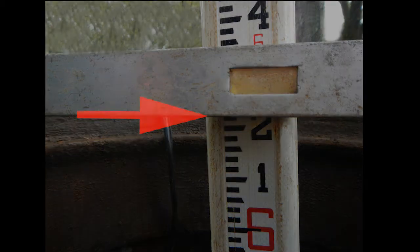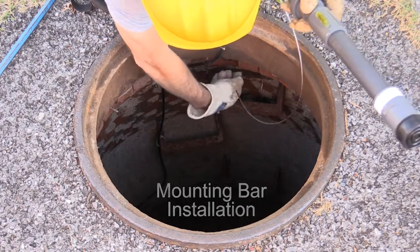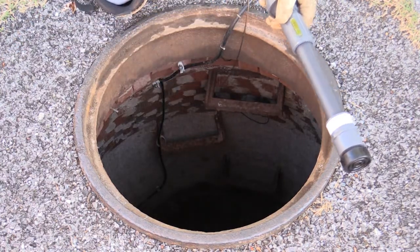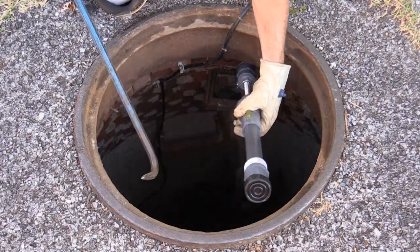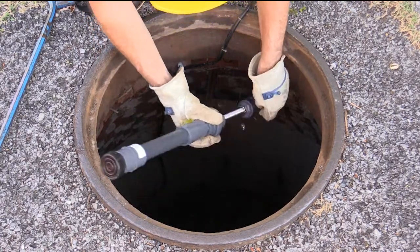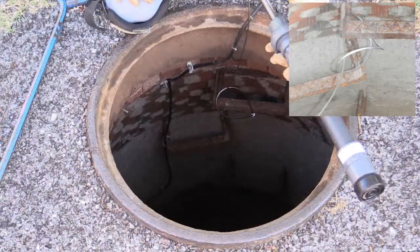Record the manhole depth measurement. Before installing the mounting bar, it is important to tether it so that the bar cannot be dropped into the manhole. Start by hanging the large loop of the mounting bar tether behind the top rung. Use a J-hook to pull the large loop under the rung and pull the large loop up towards you. Finally, pass the untethered end of the mounting bar through the large loop, cinching the bar to the rung.